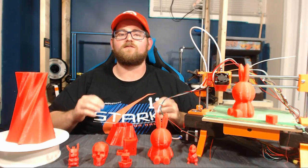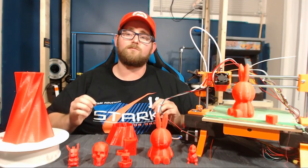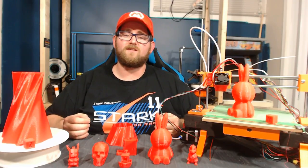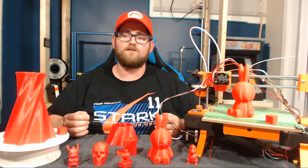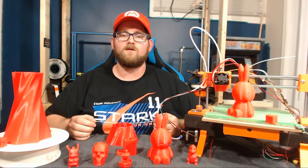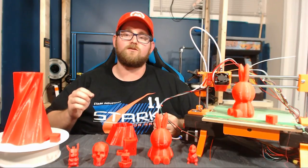Second, I had intended to build this printer as a fully contained Wi-Fi enabled printer using an Orange Pi Zero. While I was able to get Octoprint up and running on the Orange Pi without too much struggle, the Wi-Fi connectivity on it was iffy at best, and there were a couple of occasions where the Pi just seemed to freeze mid-print, leaving the printer stationary but with the hot end still switched on. I believe this is a problem with the Pi, and I will be trying it again in the future once the new one I ordered arrives.